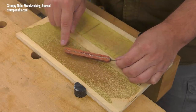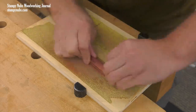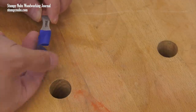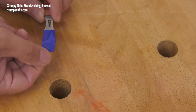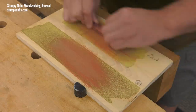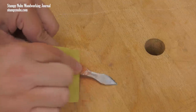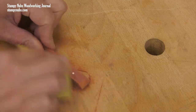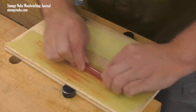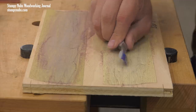Most of the work is just best done with good old sandpaper and elbow grease. I start with 80 grit, then 120 — self-adhesive roll paper is pretty handy for this, or you could use regular paper and spray adhesive. It's worth noting that while these knives are not razor sharp yet, you may want to tape the ends so you don't accidentally jab yourself. At first I'm only sanding the four flat surfaces with 80 and then 120. Then I use a little piece of 220 to clean up the bevels by hand. After that I move to 220 on the flat surfaces followed by 320, and I finish up by rounding over the four sharp edges on the 320.